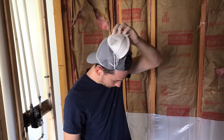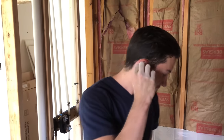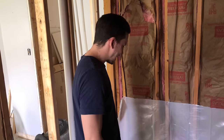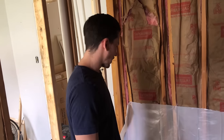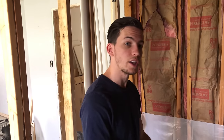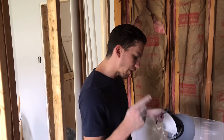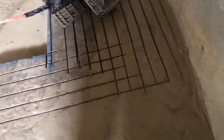We've got all our cuts made. That took us about 45 minutes using the hose and the diamond blade on the circular saw. Something interesting we noticed cutting this much concrete in this short amount of time: it got easier in some spots and harder in others. We think that's just because of the mixture — sometimes more sandy in areas, sometimes a lot more rocky. The slurry would actually change colors from gray to a sand color as you're cutting through rocks or concrete. You can feel it in the saw when it's cutting. We went an inch depth on the first seven cuts, and after seven we went an inch and a half.